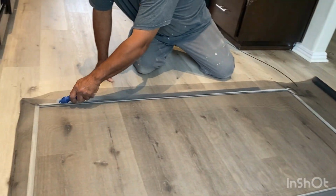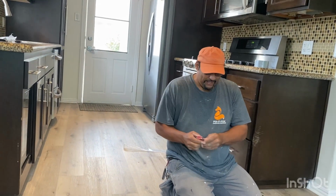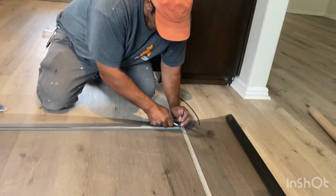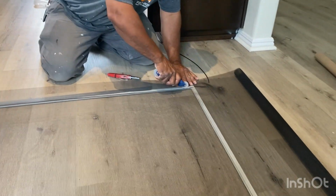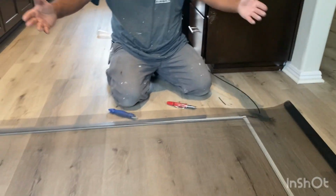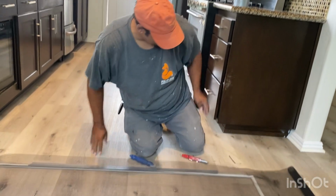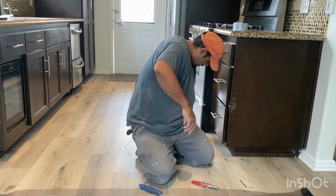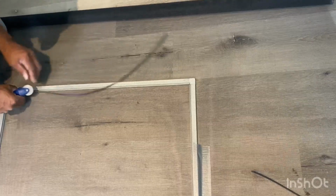Now, I don't know exactly why this happens. If any of you are physicists, leave a comment down below. But when you begin to use the tool and stretch the spline out, it grows longer. And so what used to fit in there now becomes longer, and you have to cut it off when you get to the end. Go figure. But let's grab another piece and continue on.